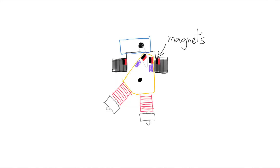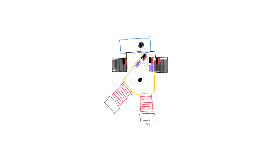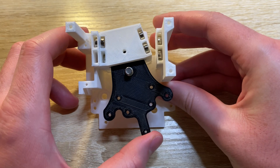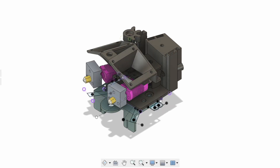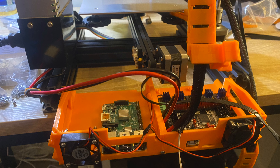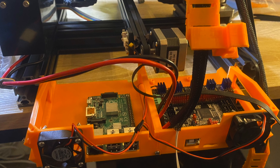Watching a video on bistable mechanisms by Wintergatan introduced me to the idea of a magnetic bistable mechanism, and so that's what I used. There are magnets in the walls of the stationary part and more magnets in the walls of the rocking hot end part. The magnets are attracted to each other and hold things in a state, and they're at their strongest when right next to each other — making this mechanism really good at holding rock solid. It's also super satisfying to play with. I spent a good number of hours in spring 2023 CADing it all out, switched to Klipper, installed the new mainboard using a remixed version of the Teaching Tech rear-mounted casing, and after many prototypes finally had something I could install on my printer.